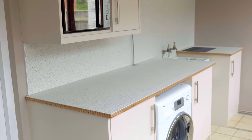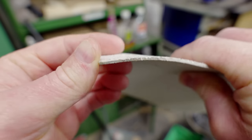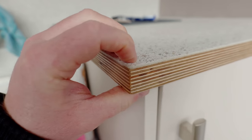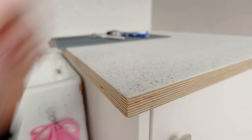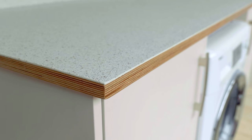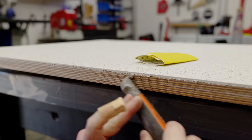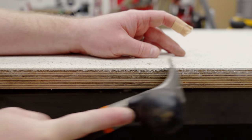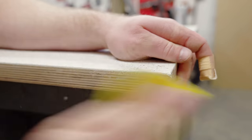I want to talk about the advantages and disadvantages of using vinyl flooring instead of laminate. Floor vinyl is quite a bit cheaper, but I've already talked about that. It's also thicker — about 2mm thick instead of 0.7mm — because it has a kind of rubbery backing which has a very slight bit of give, but once laminated onto a board there's no real deflection; it is just as rigid as laminate once it's glued down. It also looks good, and it's available in thousands of different designs, styles, and colours. However, it isn't as easy to work with as laminate — it's harder to cut, and the edges don't cut so clean because it's reinforced with some kind of mesh, nylon possibly. The edges need a fair bit of work once you cut through it, but with a carbide scraper followed by sanding you'll have edges that look every bit as good as laminate.